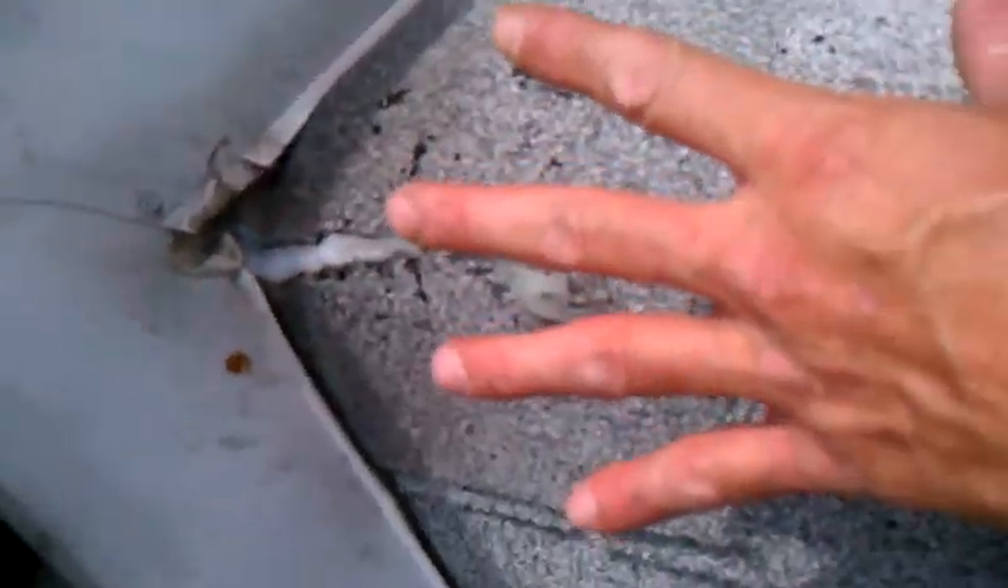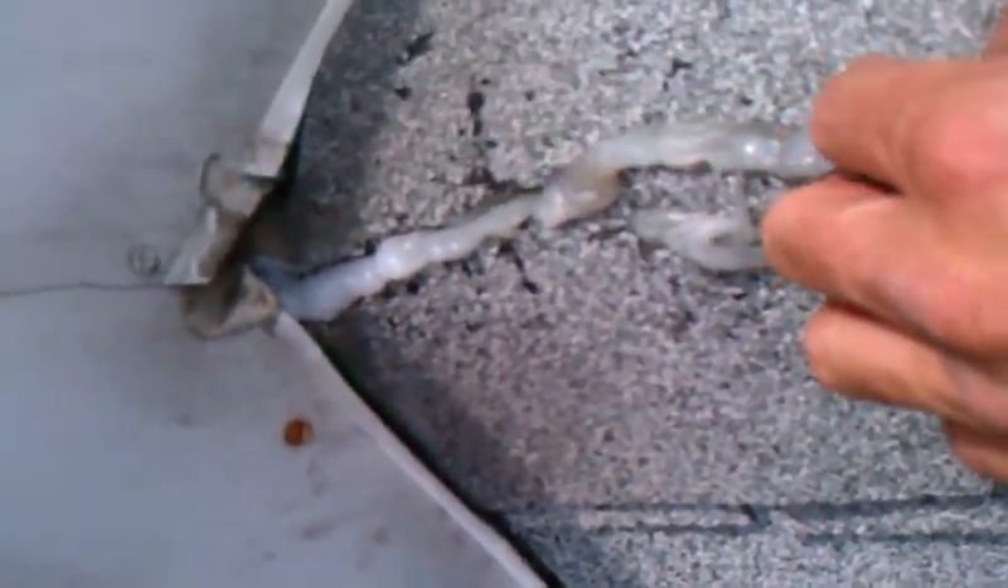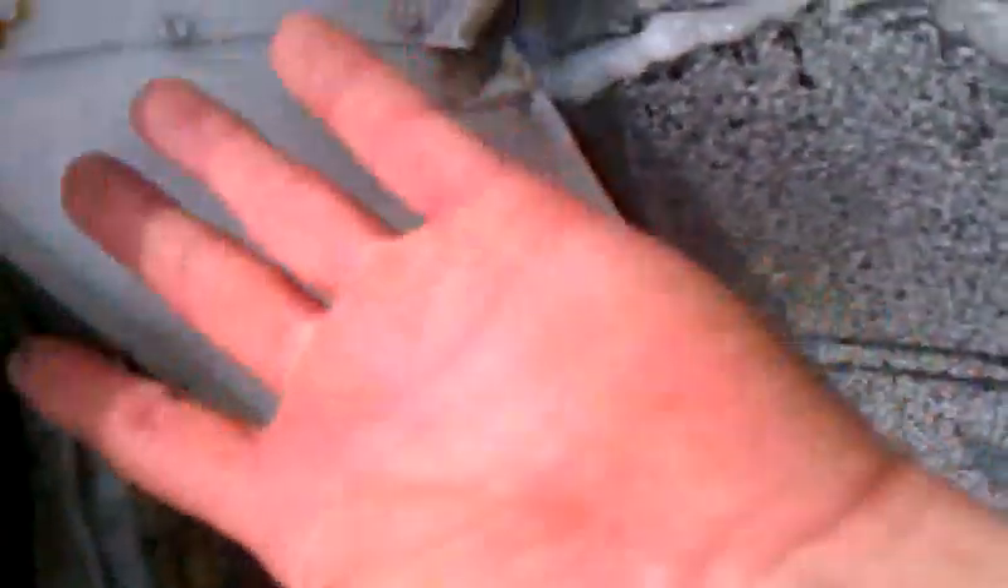What the inspector also saw was some caps that were coming loose. Basically, what has happened is these have split. I probably know why they did that - the reason is when the person putting these caps on, they probably folded the cap directly in half and made a crease in it to make sure they perfectly placed it. That's not a good idea, because see what happened here is they've split open. I think we might have some mint green shingles to replace those.